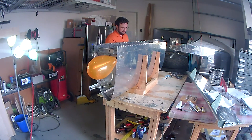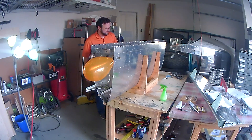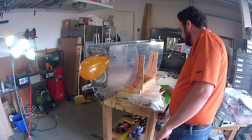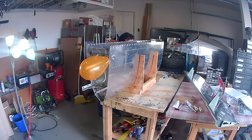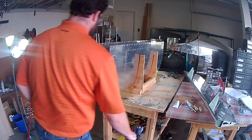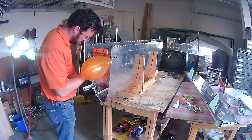Below the forward attach bracket on the bottom side front corner, it developed a leak around the glob of pro seal I put there, so I'm going to close that up. There were also two rivets with a very small pinhole leak, and some fitting issues I had to figure out how to seal. I'll speak to those in real time once I get this completed, then I'll work on the left tank.